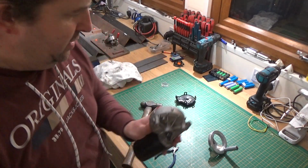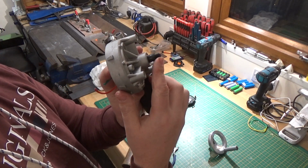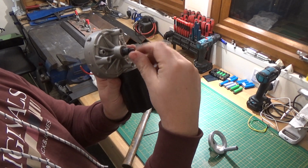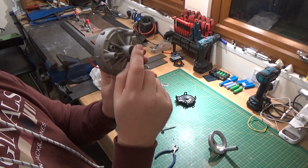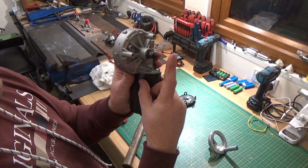Okay, so what I'm thinking is, having got an M8 thread on the end of there, making a boss that screws onto there with the M8 thread in, then butts up against that shoulder there, so we don't have to put that silly spring clip on, and obviously then that can extend as far as we want it.